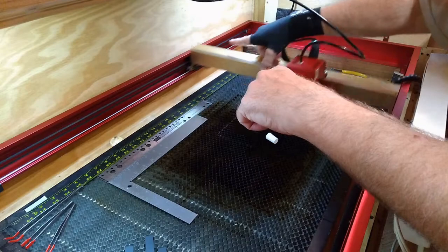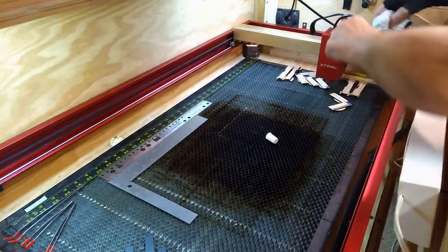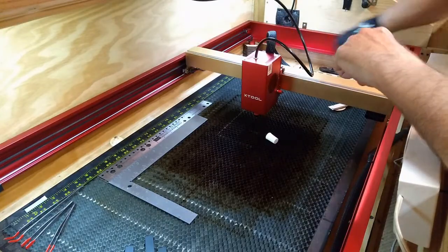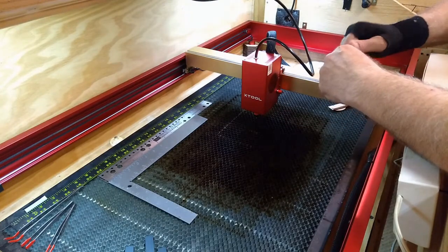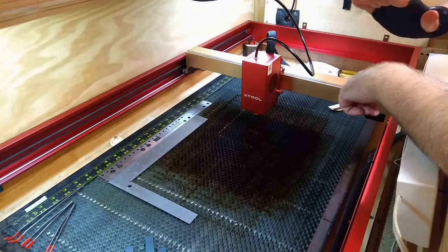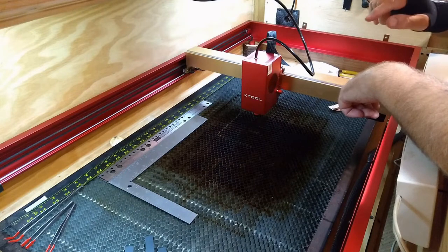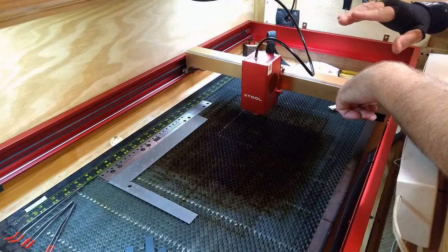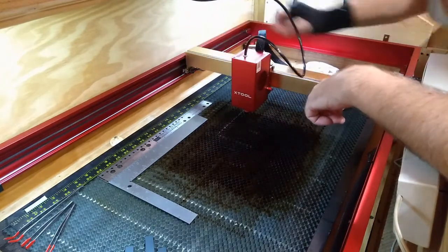Work it back and forth a little bit. And while you're in here, you might as well take your soft cloth and wipe everything down — keep it all nice and pretty. I recently did a video to clean the laser lens for the X-Tool D1 Pro 40; I'll drop a link to that in the description. So if your power is backing off and you're not getting good performance, then it's your lens that's dirty — get it cleaned up. And if you're getting jerky movements or skips in the surface of your work, it's the residue that's on these rails.